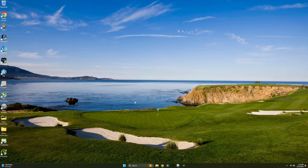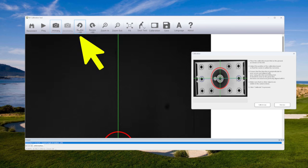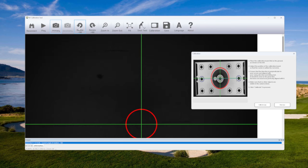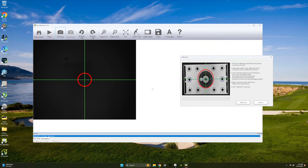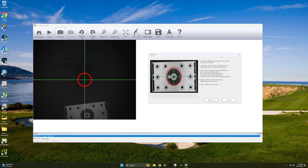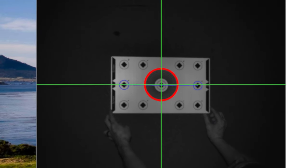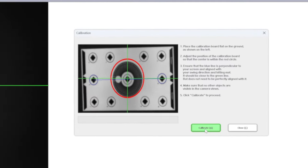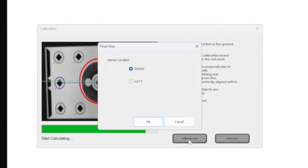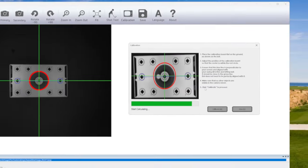Double-click on the N1 calibration app. Once that opens up, select calibration. I'm also going to use the rotate option so it's in the same orientation as I see it, which makes placing the calibration board much easier, and the zoom out option so I can see the whole area. The rotate and zoom options don't affect how the Envisage operates — they're strictly for the setup process. Grab your calibration board and place it in the area. The note on the board that says 'screen' will face your screen, and you want to place it so that the blue line is parallel with the green line. Once correctly in place, hit the calibrate option, and when presented with the pop-up make sure right is selected and hit okay. You'll get a pop-up confirming the calibration is successful.